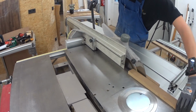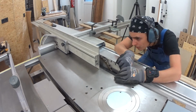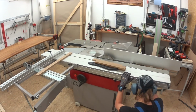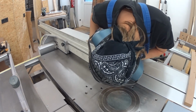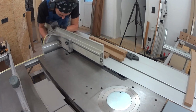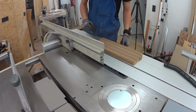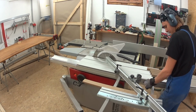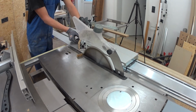As the 4 necessary stripes were cut, I lowered the splitter of my table saw to cut 2 grooves of about 5 mm depth in the stripes. One for the glass and one for the back panel. The grooves were done and I set the cross-cut fence to 45 degrees and cut the miters for the corners of the frame. First I cut the first miter on all 4 strips, and then I calculated the length of the horizontal and vertical strips and cut 2 of each length.